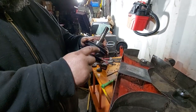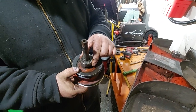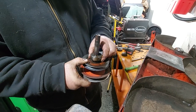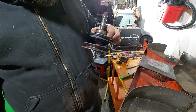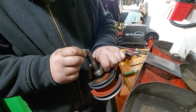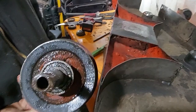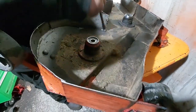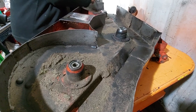This was the center spindle — as we said, it's got two pulleys and it's a longer spindle. The bearing is definitely shot — there should be no movement in a bearing like that, it's totally shot. It froze itself and came out when we knocked the shaft through. We got a new spindle because we didn't trust this one — from the movement we had, we thought it was wobbled out. Looking at it, you can see it's worn a little crooked — there's more meat on one side than the other. We're going to replace this and clean up around the bolts and threads.